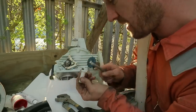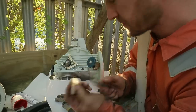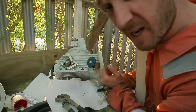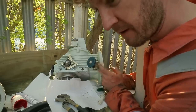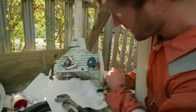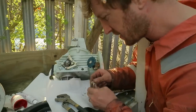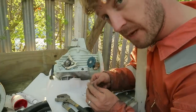So there you are. If you imagine this happened on your boat, something banged against this, this snaps off, you've now got water coming in, you can't stop it with the valve. You know, you can plug it, you can put anything you like in there really. A carrot would work, a piece of potato, you know, it's not the end of the world. But if you're not there when this happens, then your boat could sink, potentially. So I'm quite fussy about underwater hull fittings and anything that could sink the boat. I want to be hunky-dory.